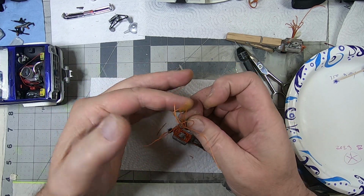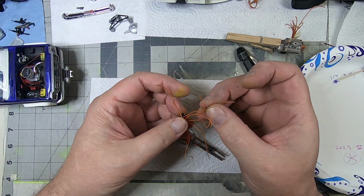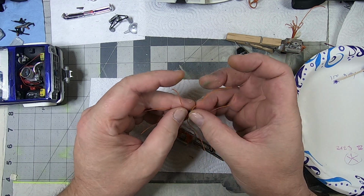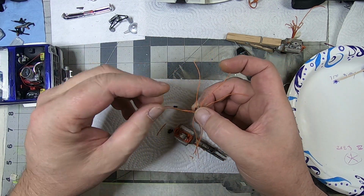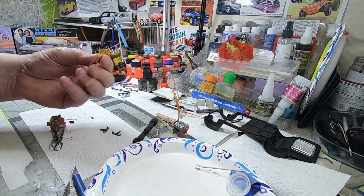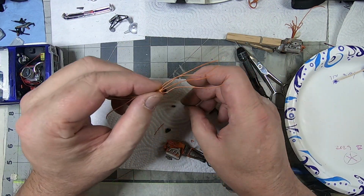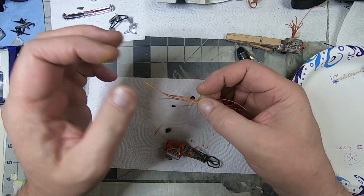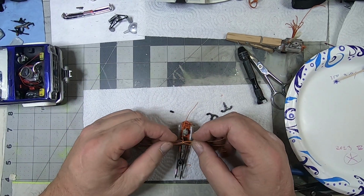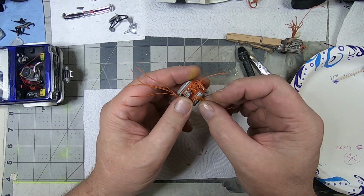And then I'll, a lot of purists are going to hate me for this, but first thing I'll do is I'll spread them out so they're all even. We got to get your little spider, come on, cooperate, I'm trying to do this quickly. There you go, get your little spider, and then 4, 8, and then 9, we'll pull the coil off to the side, then the 4 on each side to the spark plugs themselves. I'll take it and set it where it's supposed to go and kind of hold my finger there. And then kind of pre-route the wires a little bit where I want them to go.